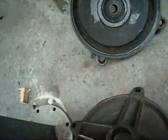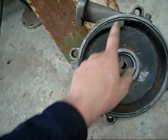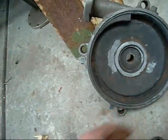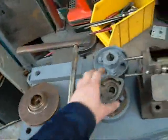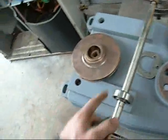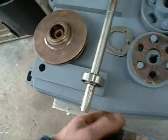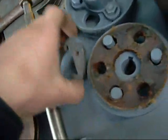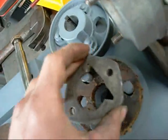It won't have the same life span — I called the manufacturer and they don't make gaskets for these either. They make the next model along which is 1960, but these early 50s pumps they just don't make them anymore. I've got one of the other parts — a gland pressure plate. I'll replace that bearing race and clean everything else up. The bronze bearings have been well taken care of — they've always been oiled so they're fine. I'm not going to go overboard on this pump.